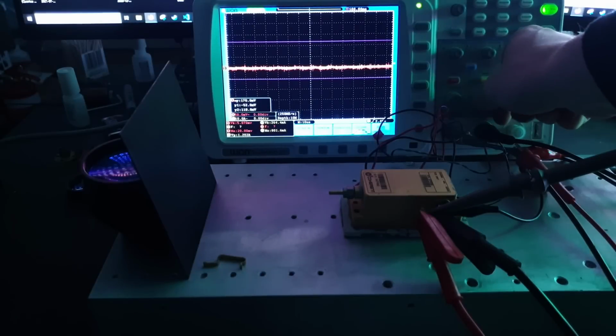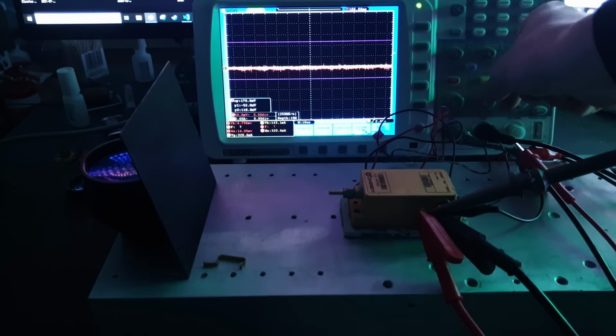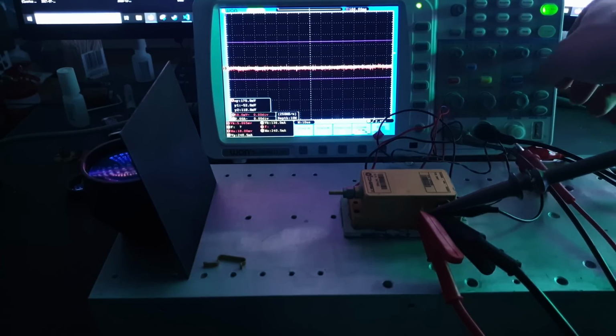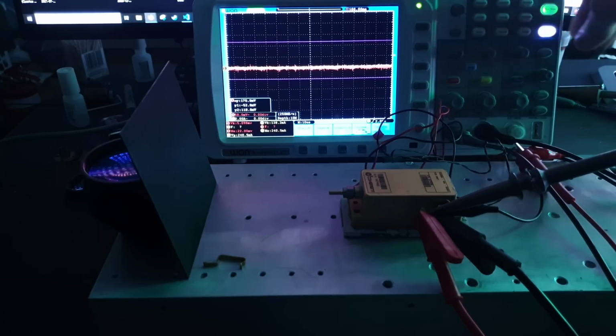Now these units can be a little bit awkward to work with. They typically have an operating voltage of anywhere between 1.8 volts to 3.3 or 3.4 volts, and they typically draw between 40 to 60 amps of current. This unit here is rated at 50 amps, but I'm not going to be pushing that hard today. The maximum output of the power supply is 21 amps, so I'm going to push it up to that and see how well the power supply performs under load.